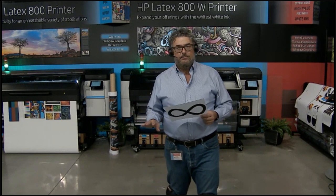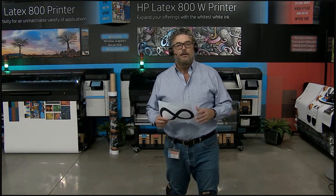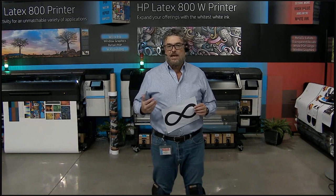New nozzles, smaller drop size, more nozzles — 3,000 versus 2,100, roughly 50% more. If it's a non-white printer there are eight print heads; if it's a white printer there are ten. Constant micro-circulation throughout. HP develops our own print heads — we have all our own patents, we invent print heads. We are a print head manufacturer. That includes all the electronics, waveforms, and testing. We have teams in San Diego, Boise, and Corvallis for print head and ink development.